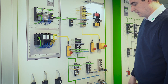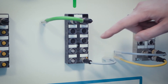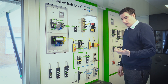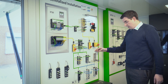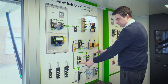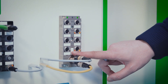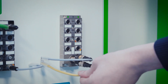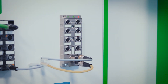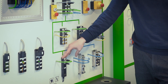We also have IO-Link ports with DIO ports on there — four IO-Link masters and 12 configurable DIO units. Using our IO-Link hubs, specifically with this K3 module, we have the same full galvanic isolation between the inputs and the outputs, so that the IO-Link communication is done through the grey cable and the safe voltage for the outputs is fed through the yellow cables. When we press the E-stop it shuts down that entire side and makes all outputs considered safe.